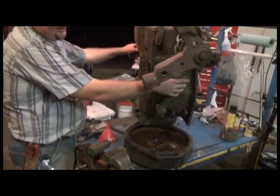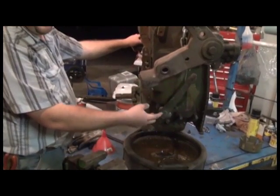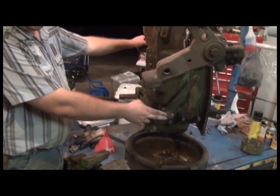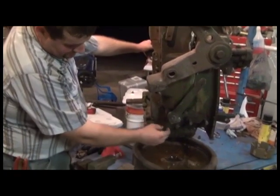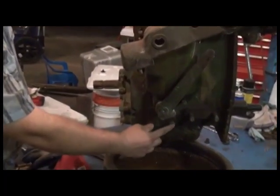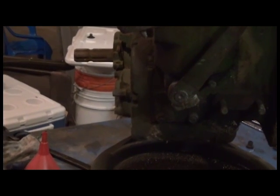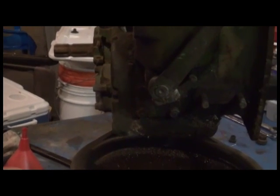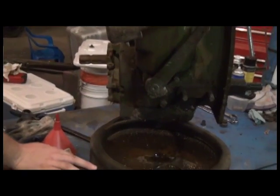It's engaged and disengaged by linkage to this lever and arm. It goes in and engages the clutch pack and provides spring tension, or disengages. This little window right here, this plate held on with I think two studs and a bolt, is where you would go to make the final adjustment or to adjust your power shaft clutch. And yes, this is something that would normally need to be adjusted.